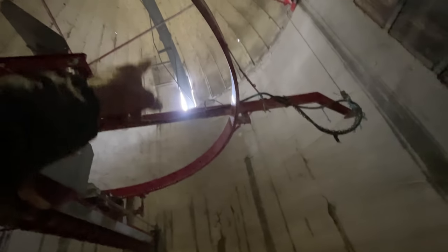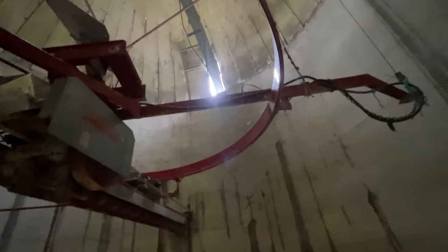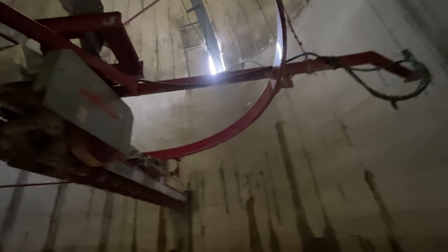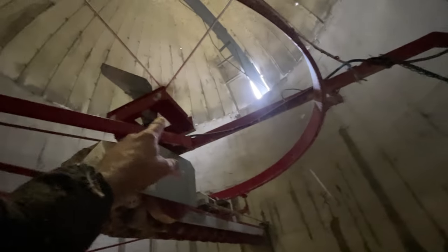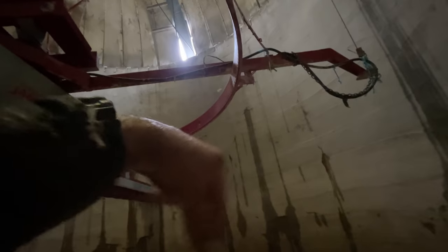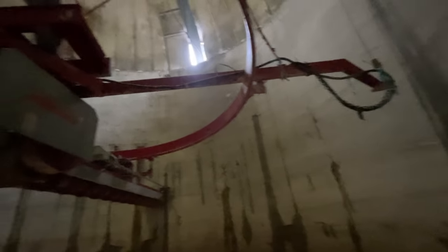It has settled roughly about 15 feet. The material comes in on that side of the silo through the gooseneck in the roof, and comes down on top of the distributor. The unloader runs while we're filling this — it's got a spinner on there that spins the corn to the outside of the silo, and the outside fills in so it kind of fills up like an inverted cone.